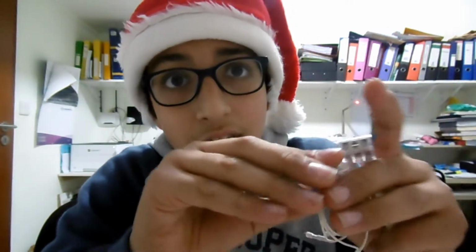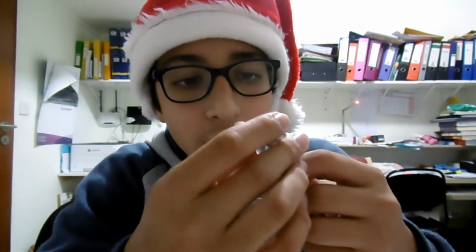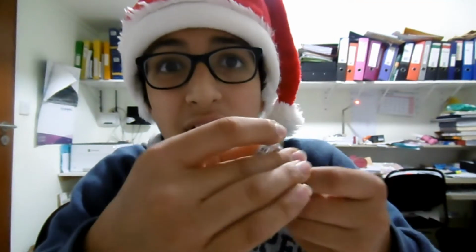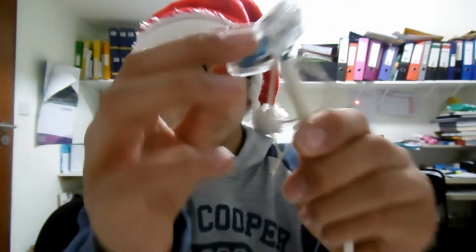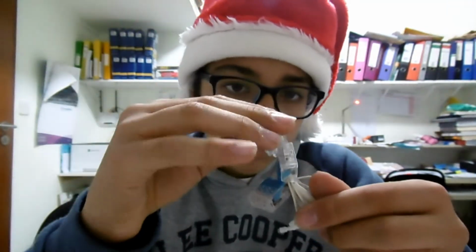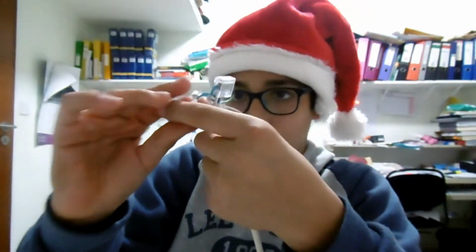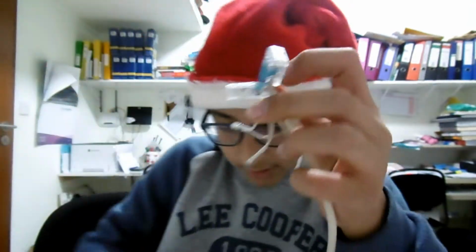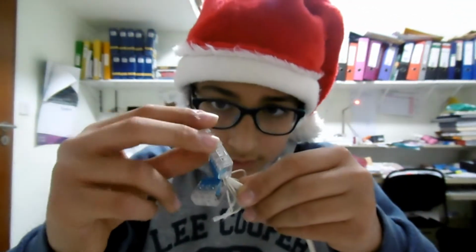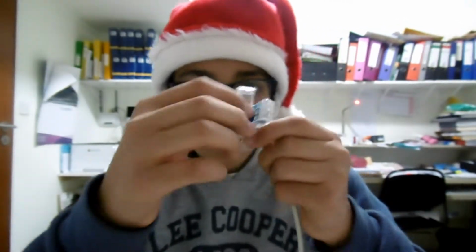And now, before you ask, the green wire is because this wire was used in high voltage. This is going to be used in low voltage, which is why we don't need it. And also we don't have any metal either. The only metal is inside glass, which is an insulator, so we're safe. And so this is how it's supposed to be, and the earth we put in a Wago, like that. Always use Wagos properly, or else it won't turn out so good. And there you have it.